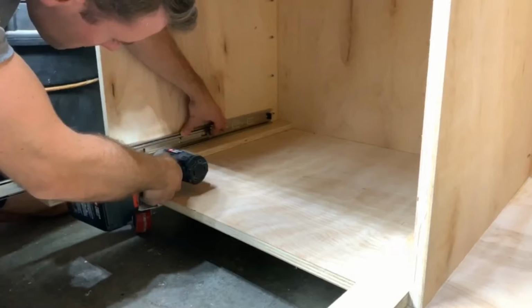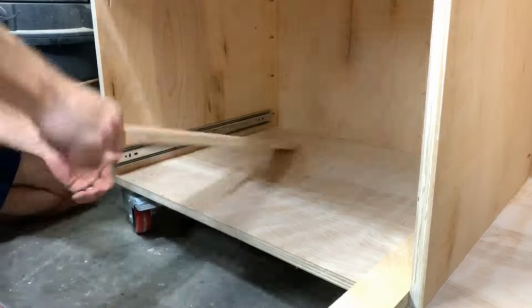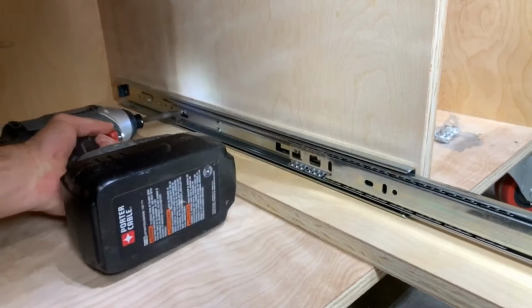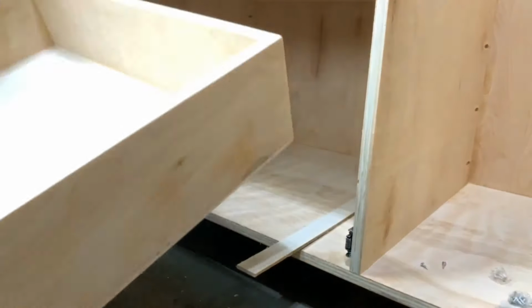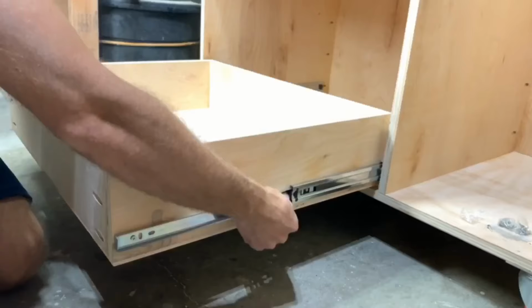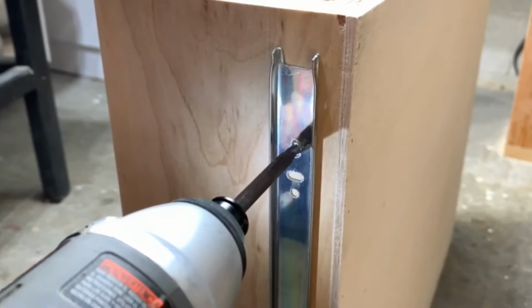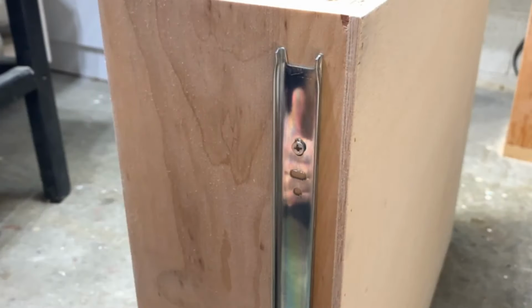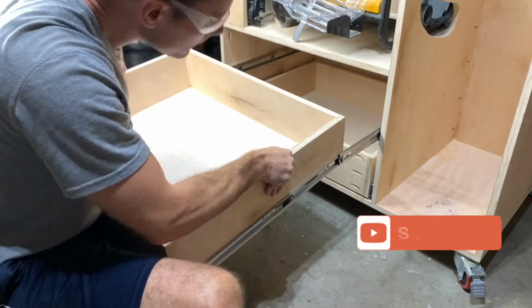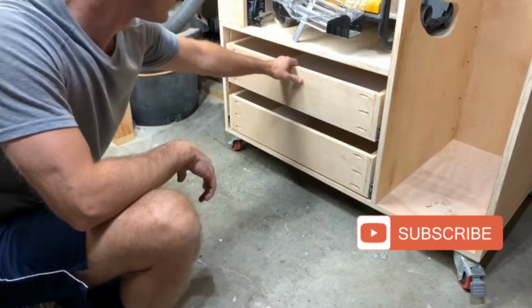I elevated the drawer slides using some 3/4-inch plywood scraps and secured them to the inside of the cavity using 1/2-inch screws. I then used some 1/4-inch scraps under the drawer and attached the first 2 screws before disconnecting the slides and driving through the rest of the screws. I reattached the drawers and checked for proper function and was so relieved that it actually worked.